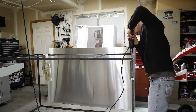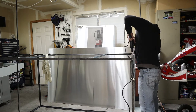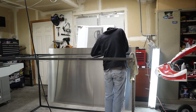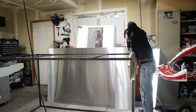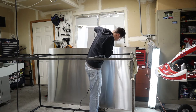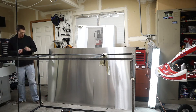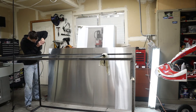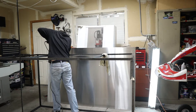These are the holes I'm going to use to bolt the sheet metal to the frame. I ended up using a number six, which is a little bit over an eighth inch diameter. It was just mark it, center punch it, and drill it — repeat and repeat and repeat. I don't remember off the top of my head, but I think it was like 60-something screw holes, so yeah, it took forever.